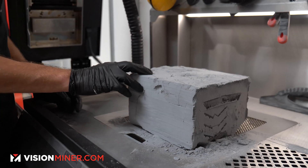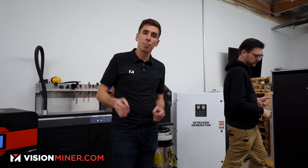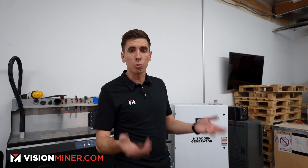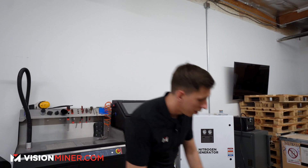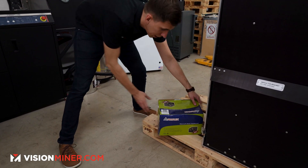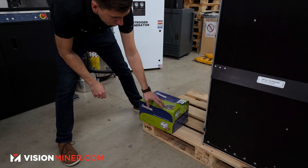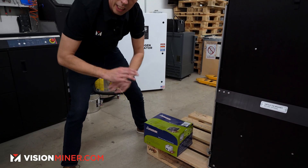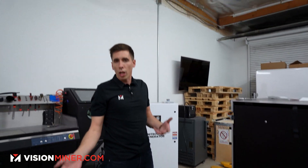If you're in the USA you might be wondering: can this plug into a standard 110-volt outlet? The answer is yes. In the US, every machine is 240 or 220 volt, but they come with a transformer. If you don't have 220-volt connections in your shop, you're covered — it comes with a super powerful converter box that lets you plug it in anywhere: a garage, an old university building, or your shop.